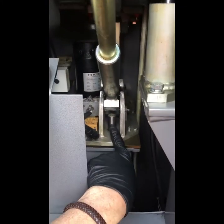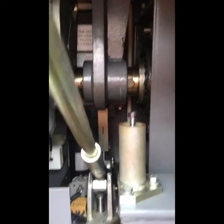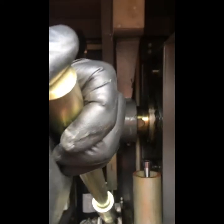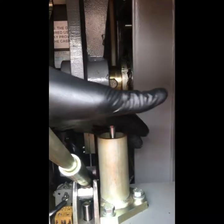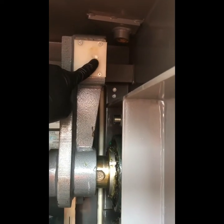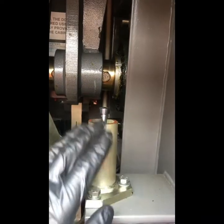You also have a few other things: once you have your pump handle accessed from the maintenance side, you have to pull the handle out and then you can start pumping it. It drops down into this slot and starts acting on this piston — it pumps up very jerkily when you're doing it. You also have the back piston, so when the arm comes down it takes some of the shock off it, and finally the sacrificial plastic pad, which also gets a bit of wear from the piston itself.